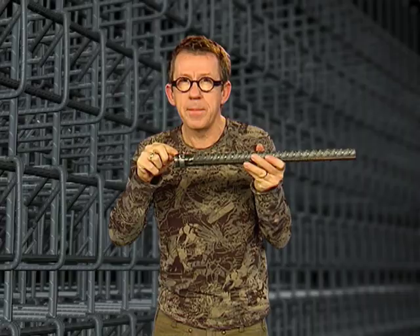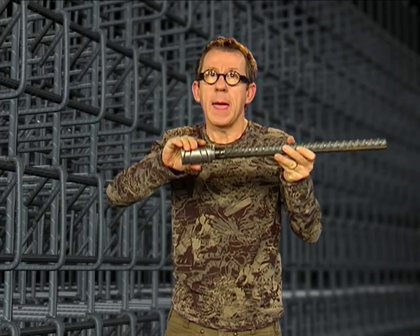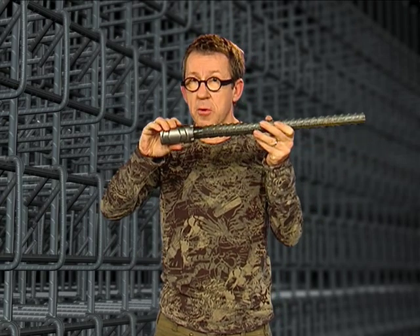Using this technique, the bonding bars are upset — that means they're compressed at one end to increase the diameter. The density of the material increases, making the metal more resistant in this area. They are then threaded to screw into the coupler. Two rings known as lock nuts are then used to lock the bars on each side of this new rebar coupling device. The coupler is not only smaller and lighter, it's also more resistant than the other connectors. It has improved bonding qualities, especially with its raised pattern, from which it takes the name Erison, meaning hedgehog. As a result, concrete and steel have never been so intimately coupled.